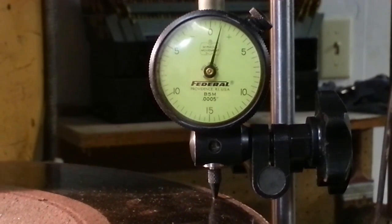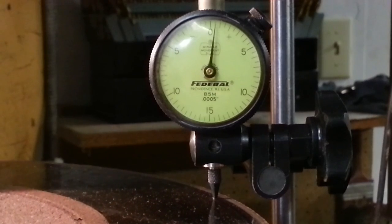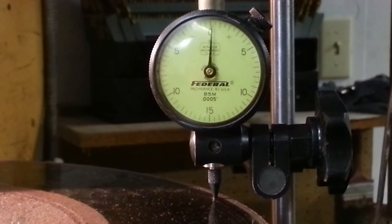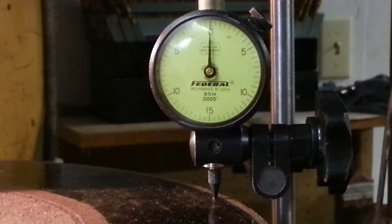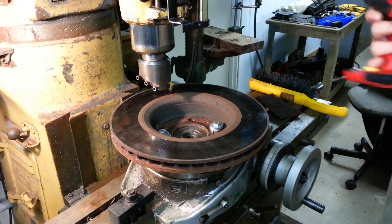The reason I have it that way is that's basically what I need to machine this true to. This surface has three and a half thousandths of runout, and the other surface — I haven't measured it — but I'm sure there's runout on that surface which is not parallel to this one. So by machining the inside surface first with it clamped on the wheel mounting face, I can get this surface flat, and then when I flip the rotor over and machine the other surface it will be parallel to this surface. Let me show you how I'm going to machine this.